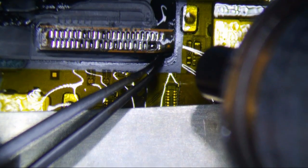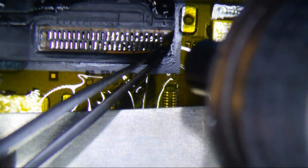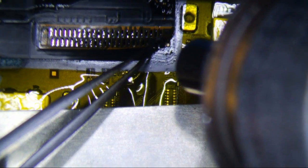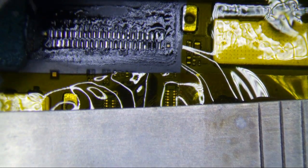As you can see it's already nice and shiny, which means the melting point has already been reached. You really don't want to pull on it — you want to wait until you can get a visual on the solder. Make sure it's liquid. Once it's liquid, then you can start lifting a little bit. As you can see, the connector comes off pretty cleanly with very little effort.